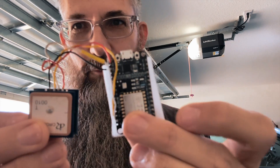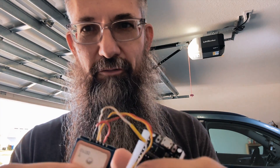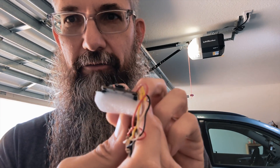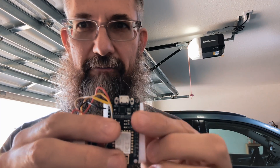Do whatever you want to do with it. Wiring it up is pretty straightforward — it's got four pins that you need to wire up: TX, RX, ground, and input voltage, which is 3.3 to 5 volts, though this board puts out 3.3 volts. You can either power it off USB or wire it to the two pins on the other side — a ground and a 5-volt in. To use the GPS code, you're going to need TinyGPS Plus, a little library for Arduino, and you'll install that.